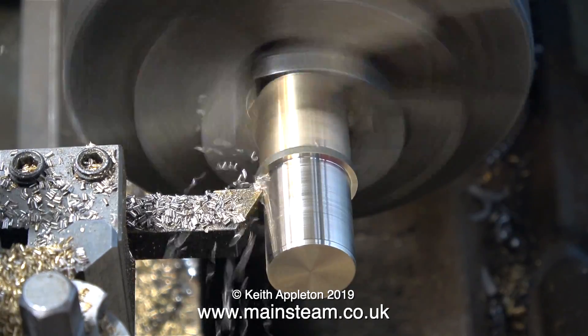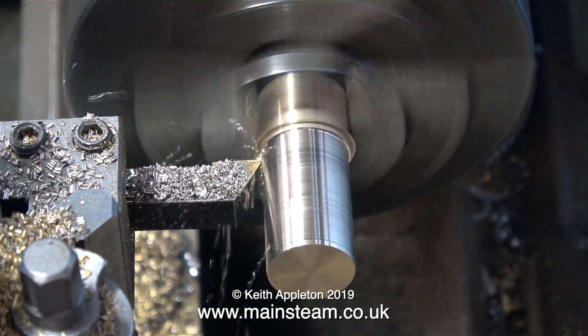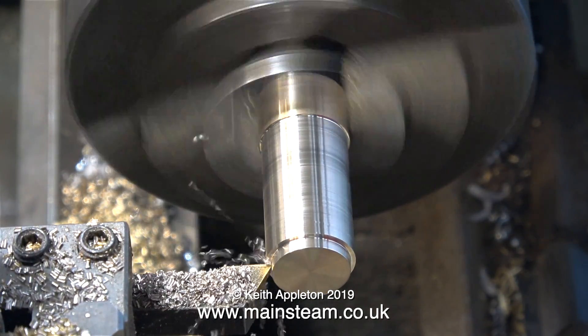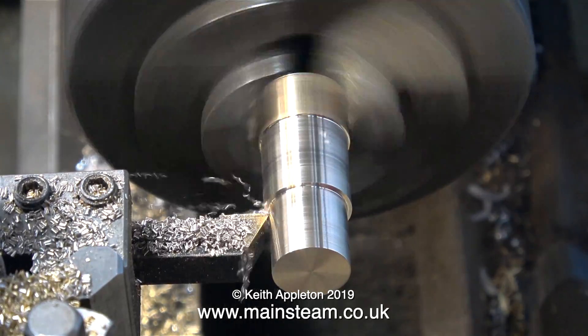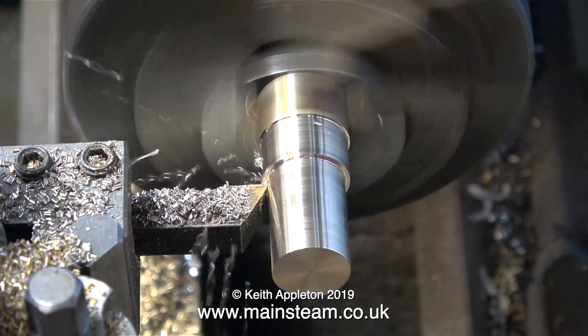I have a recommendation: if you're going to make your own steam fittings, make them out of phosphor bronze, not out of brass. And why's that, I hear you ask? Well, over time, in a steam boiler application, you can get problems with brass fittings. It's something to do with the zinc content of the brass — over time they can become brittle, and I've actually seen this on very old steam engines.